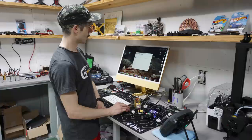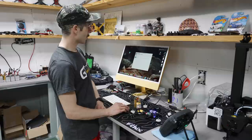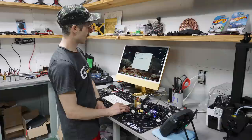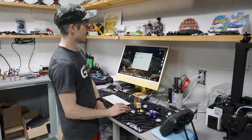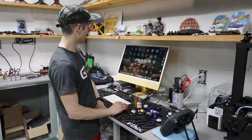So yeah, now we've gone through, I went KISS pass through. I don't have the quad powered on, so the ESC is not getting power, so it's not going to take you there. And then you have this Fettec FC-G4 firmware version 1.0. So you select remote firmware, and then you can pick what Fettec firmware, it's really a KISS firmware, you want. And in this particular one, the latest is RC-47M. So that's the one that's on there right now. I'm not going to change it. So just disconnect, go back to the KISS GUI, and I'll show you the PIDs and the setup that I have in there for that.